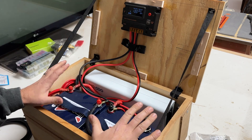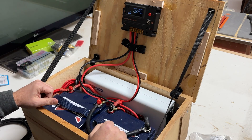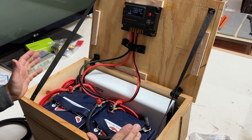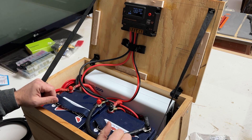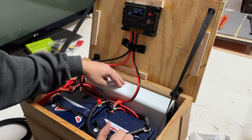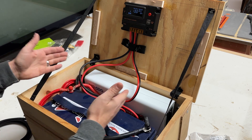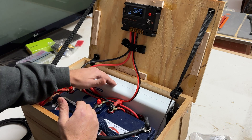There were a couple comments that when we built this, we didn't put any fuses or circuit breakers in here — and that's true. I probably could have wired this a little bit nicer and put a circuit breaker or fuse box in here. To be honest, unless something shorts out in here — which would be a catastrophe no matter what — this already has overload protection. If I pull too much power from the inverter, it's going to shut off. So I'm not really worried about having an AC circuit breaker, because there's no way to overload this. It has basically an electronic breaker built into it.